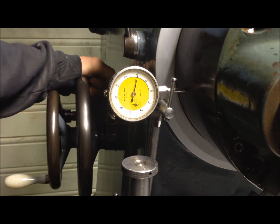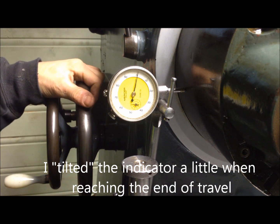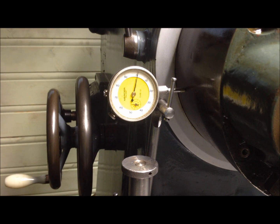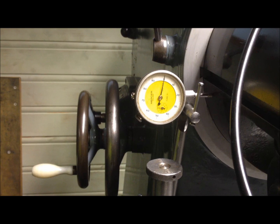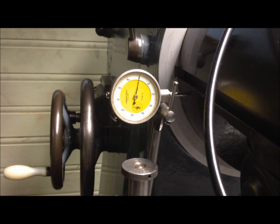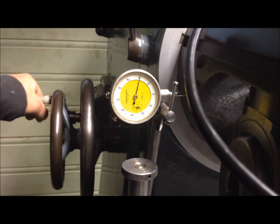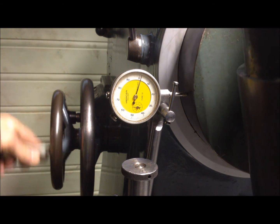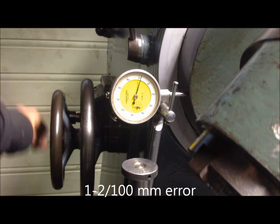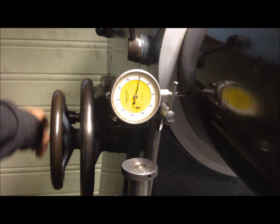The very last bang of the head produced half a hundredth of a millimeter, which is two tenths. Now measuring the roundness of the column, or its travel around its axis. I zero the indicator again and then starting travel — I can immediately see it goes on to one to two hundredths of a millimeter, a little beyond. Does it go back again? Yes it does.